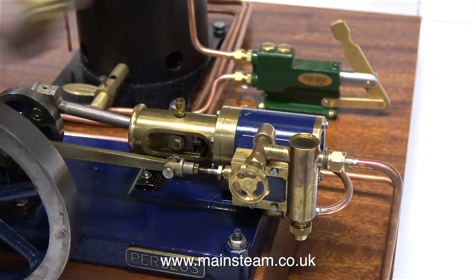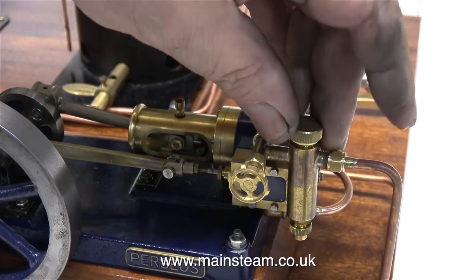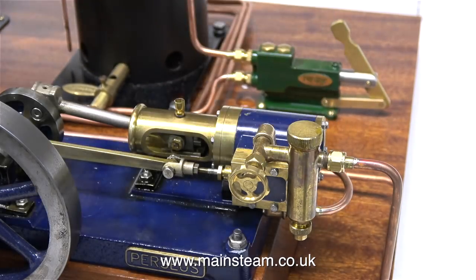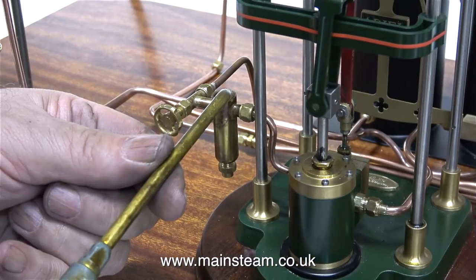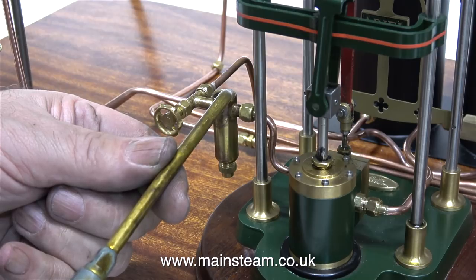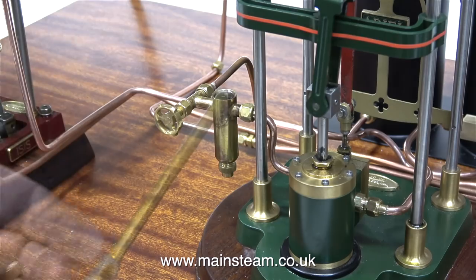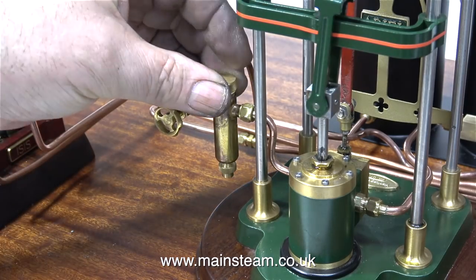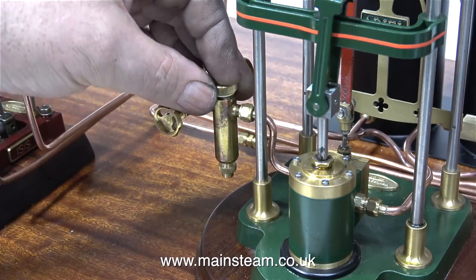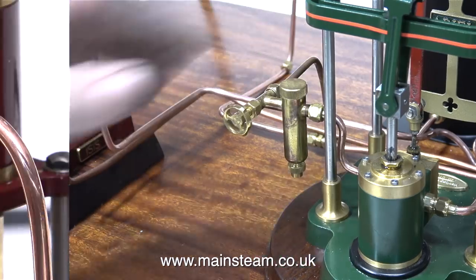Surprisingly, I didn't receive one comment telling me that I got the displacement lubricators the wrong way around. I did it this way so that all of the taps were facing the operator. The only one that is the right way around is the one on the aerial engine, and as you can see, the short pipe from the tank goes to the steam inlet of the engine. By piping the displacement lubricator valve assembly this way, the valve cuts off the steam to the displacement lubricator. But doing it the other way, I cannot cut off the steam to the lubricator.